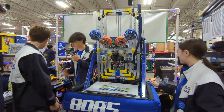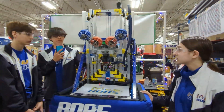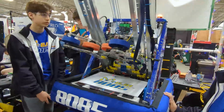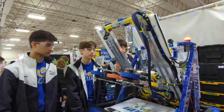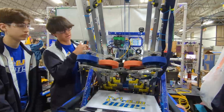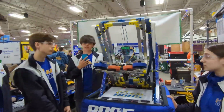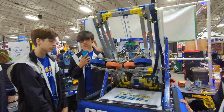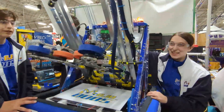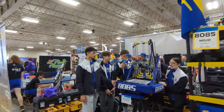One of the new things we actually just added — again inspired by Buxrath — is while we're placing, we wanted to have our arm get into the set position a little bit quicker. So we decided to angle the elevator as we drive into the community zone. That way, instead of having to alter the altitude, which moves slower than the extension because the altitude dropping is only affected by gravity — as you can see, these pulleys just allow the elevator to come down, we don't have an active motor bringing it down — to speed that process up, we have it drop into this position as soon as we enter the community area. And then from there, Joey can score high — we can reach all the way out and then place it. It just speeds up the whole process a little bit.